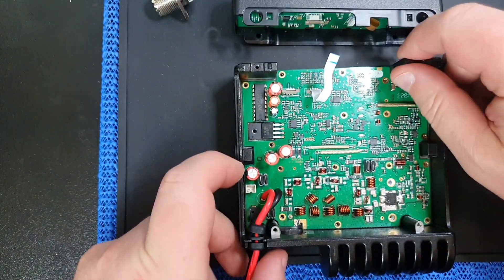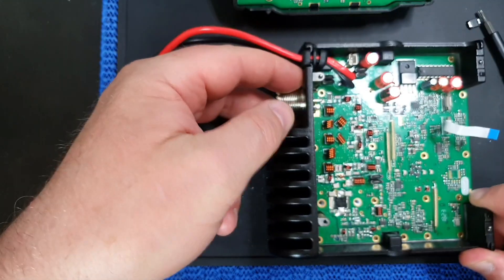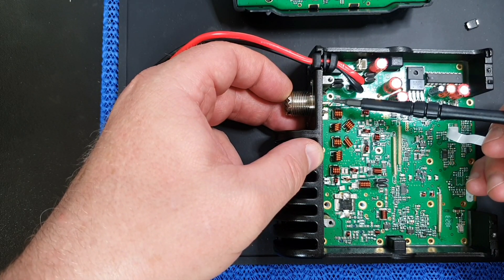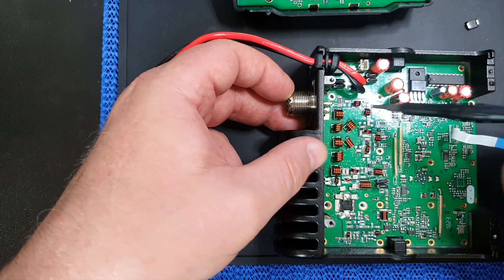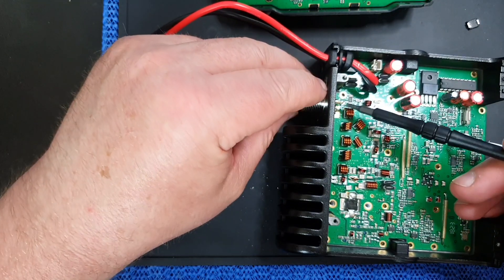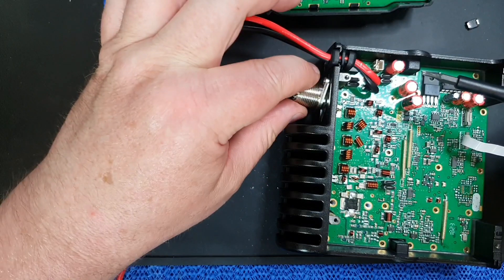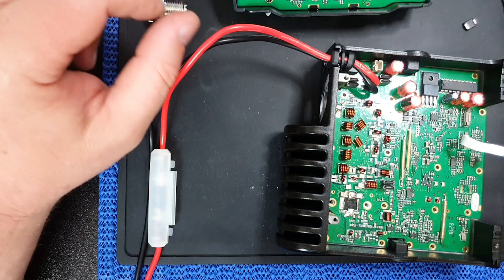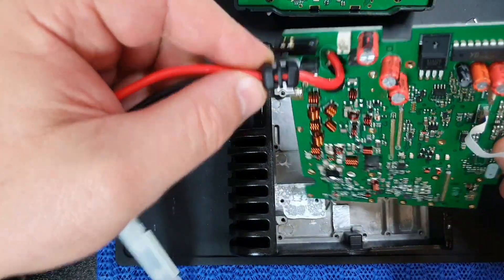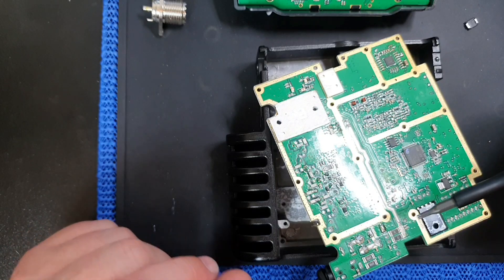What I've done here is on the back of this connector, I've removed the two screws. That renders this whole thing hanging on by these connectors, this piece of wire, and the earth connection. What you need to do is use a solder sucker to keep removing solder until eventually this just drops out. My advice is really not to force any of this stuff — you can pull the track off of the main board. Once this is all out and you've got all the screws loosened, bear in mind there is some horrible gunk underneath.